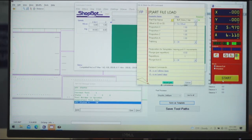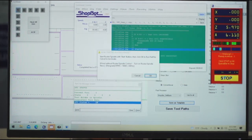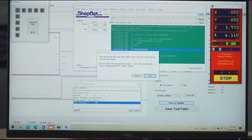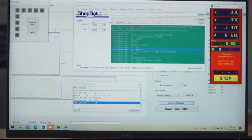You're making a cabinet called IWF Demo — we are. This is about to send the signal to the spindle, and it's going to talk back and forth — it's telling me to turn on the spindle because we're ready to go. We should hear that start up. I have to turn the vacuum on to make sure that's going to hold down. Clicking okay and away we go.